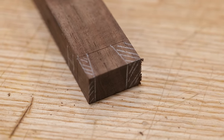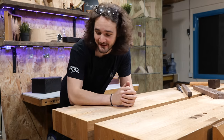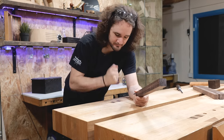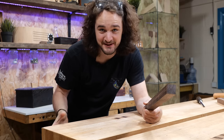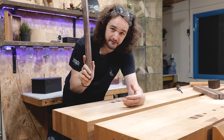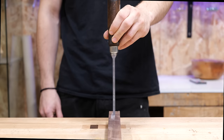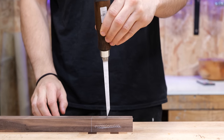With all the layout done, here's a quick tip for cutting mortises. My bench is about five inches thick, so I can place work anywhere and get good support from underneath. Listen to the difference in sound when chopping above the leg versus elsewhere — even in a five-inch-thick bench the difference is dramatic. Positioning the mortise above the leg gives much better power transfer. I also position myself to look down the length of the mortise to ensure I'm cutting plumb, because looking from the side can easily result in over- or under-correcting the chisel's descent.